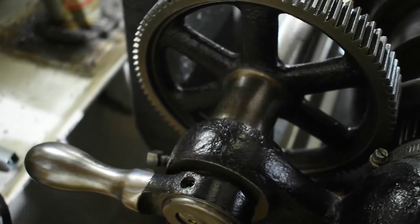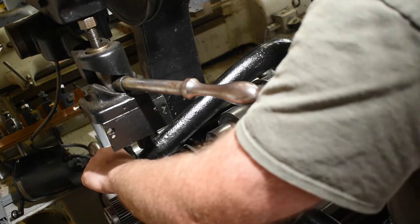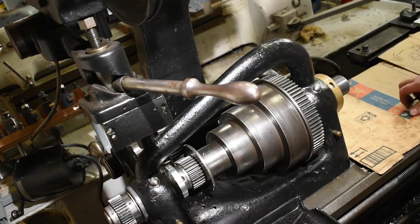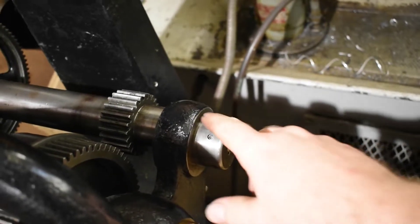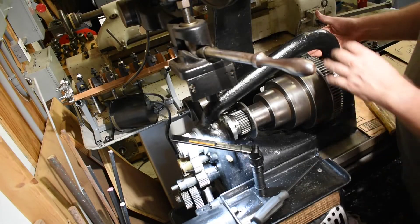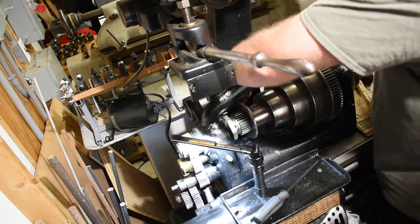Off camera I'm going to remove this set screw since it's hard for you to see. The screw's back down. So now we need to drive this shaft this way a little bit, enough to get the handle off. You can't drive this shaft all the way through because there's a woodruff key that holds this handle in place, and if you try it's just going to run into the end of this big cast piece and damage it. So what I'm going to do is use a brass punch to drive this shaft a little bit this way. Now that the handle's off, we're going to tap the shaft back in and grab this woodruff key and remove it. Now this entire shaft can be pulled out — grab the back gear casting in one piece, wiggle it out. You might have to drive it with a plastic hammer.